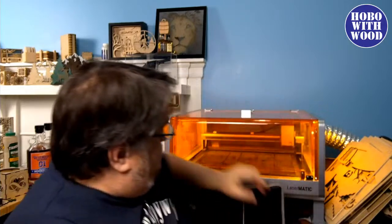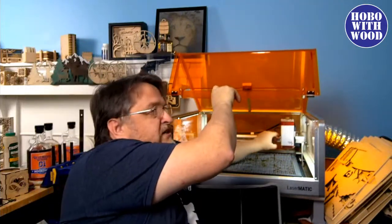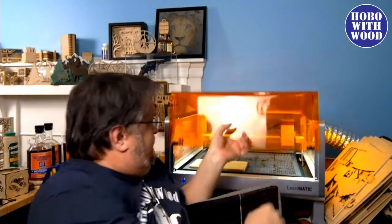Do you remember what speeds we're working at? And we're working with bamboo. We're not doing low and slow. Now, I'm going to do the 10 watt. So this is the MK2 30 watt/10 watt. I'm going to switch it to 10, leaving the focus 5 millimeters above the surface. And grab another one of these. And now the 10 watt.